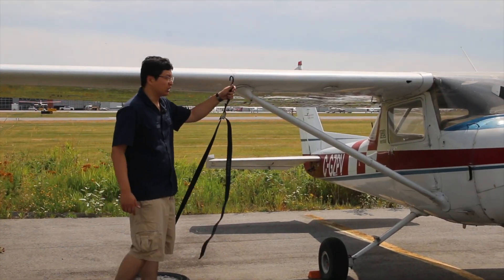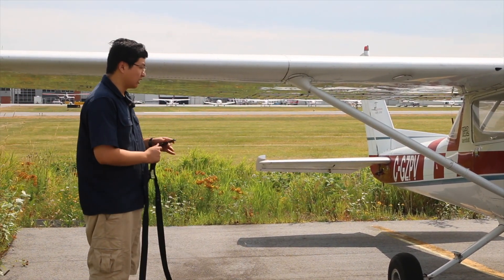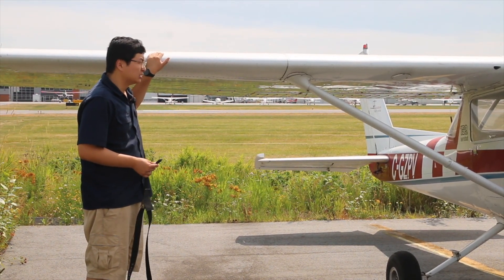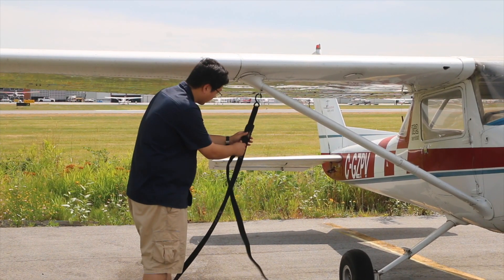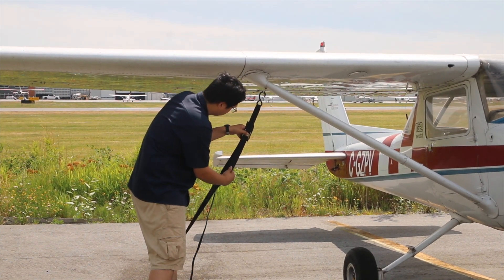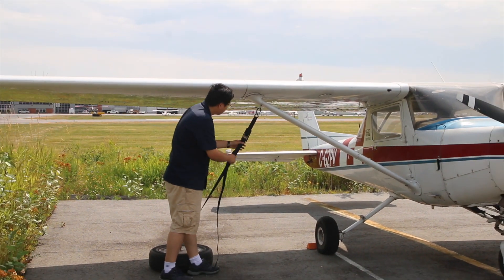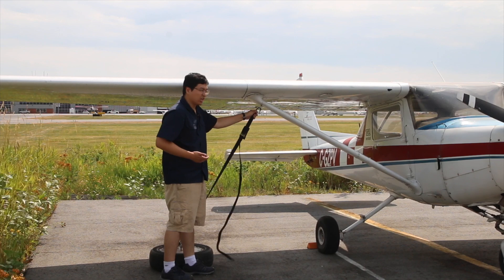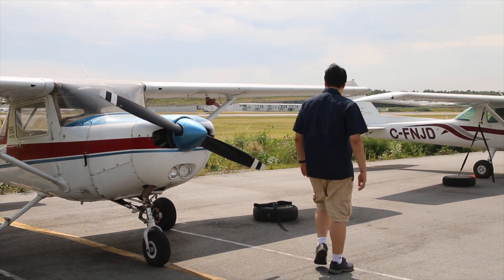After parking the aircraft into position, there's one more thing to do: securing the aircraft with tie-downs. We do this because the aircraft wobbles a lot in high wind conditions. We have these tie-downs, and we tighten the straps by holding down the knuckle and tightening the strap. Make sure they are tight, but you don't have to go overboard — as long as it doesn't shake itself free easily, it is considered secured. Now we do the other side of the aircraft.